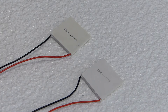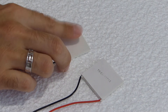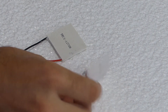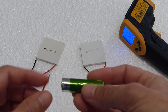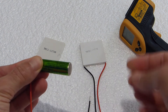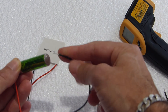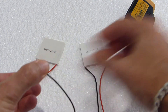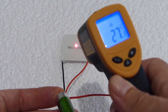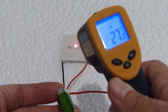I will be using these modules for cooling and later creating a mini fridge. The first step is to determine which is the hot side and which is the cold side without damaging the modules. To do this I'll use a 1AA 1.2-volt rechargeable battery of 2.1 amps. The red wire goes to positive and black to negative. As you can see, this side is getting colder — you can also check by touching the surface instead of using a digital temperature sensor.